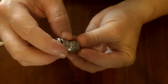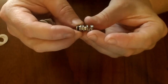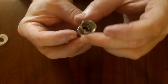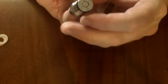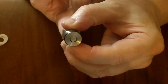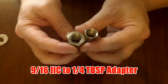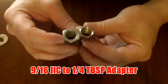The other style, which we seem to be getting a lot of here lately, are these. It's just a spring and the little valve, and that's actually only held in place by the keg post itself when it screws on. It gets held in place like that. So both posts have the same thread. It's around a 9/16 JIC fitting, which is used in a lot of automotive and hydraulic type systems,